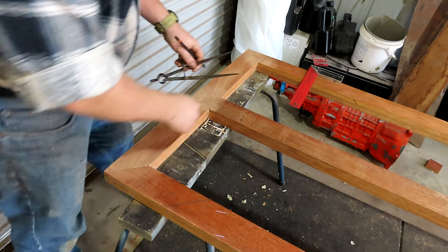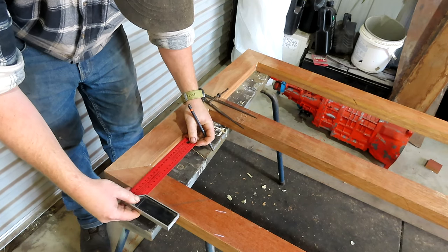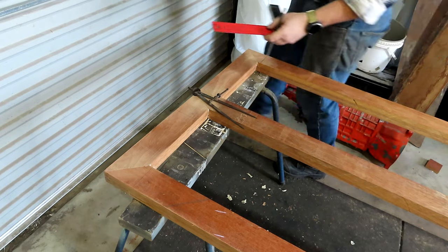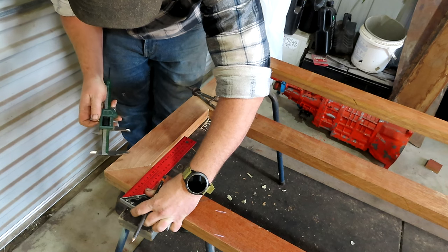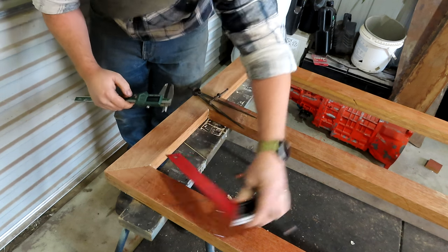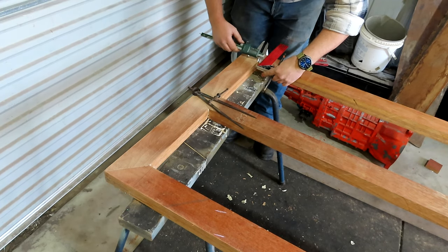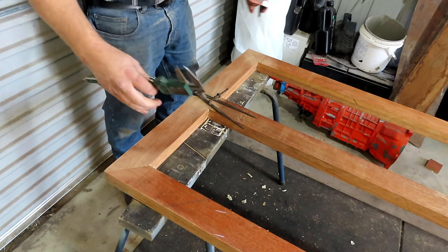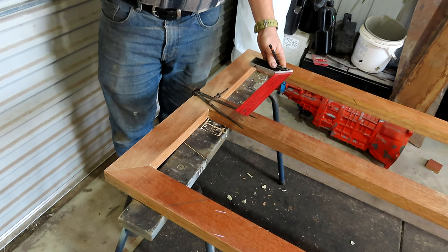All right, so it was very close, but it's just off. So there's the edge of the wood. That's where we are. So we're actually, where'd my vernier go? Now I don't know if I'm just being too pedantic or not, if I'm trying too hard to be accurate, but 11.5. Is it the same? So are we actually square? 13, not really. 2 mil. I could live with 2 mil being a bit wonky. 13. Sorry, 11. Oh, let's split the middle and call it 12.